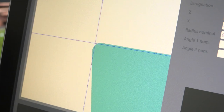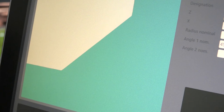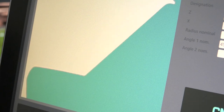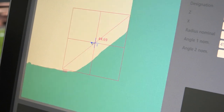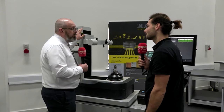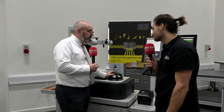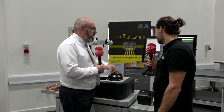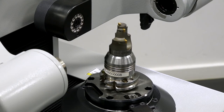It's about this system being really modular. It's not just that if you need CNC you have to get clamping as well — you can get clamping without CNC, or you can mix and match. This machine is full CNC, and we can still move our axes around manually like we can on all our machines. But this one is going to be operator independent when measuring tools. We have our autofocus spindle, and now we have a CNC axis with a rod encoder on the C axis, and our X and Z axes are fully automated.